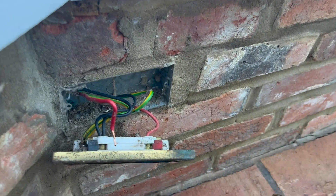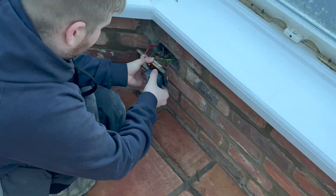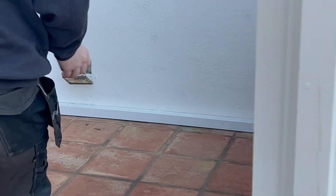We've got one more that's next to the fuseboard. I'm hoping it's that leg because this one's going to be a nightmare. But look — someone's already had a problem here, because that's coming from a different direction and there's not even one out here. It's hoping to be from that one to there, or that one to the board. We narrowed it down from that socket to that socket, disconnecting the light — because it's the MCB tripping not the RCD, we knew it'd be a live issue.